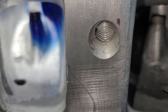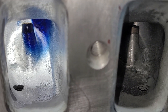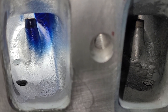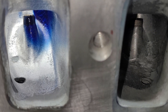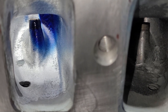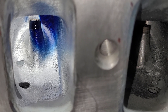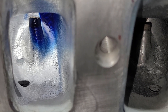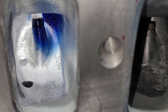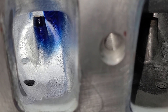The owner may say the filler gave him so many CFM, but this actually works better — I'm surprised how well. You have to remember a couple things: one, it's a massive 2.25 valve for a huge 500 cubic inch engine. The port is horrendously bent, and in order to get the air moving around it, it's going to need a decent size port. I like filling it and making it more efficient, but the short side speeds were ridiculous — it wouldn't have run well. He put it through his program and it made good power.